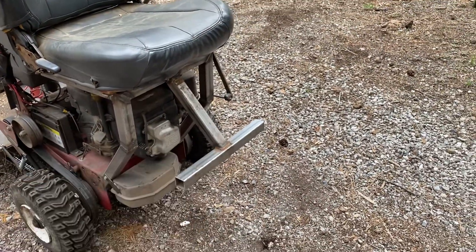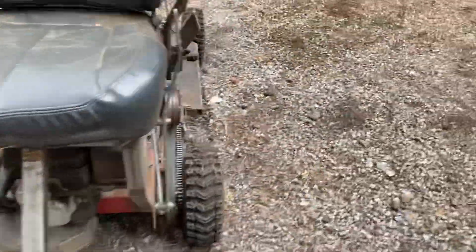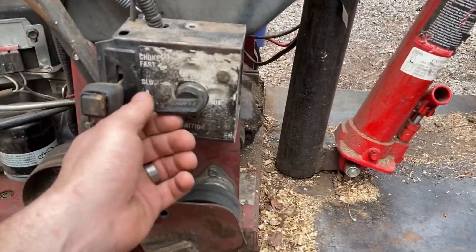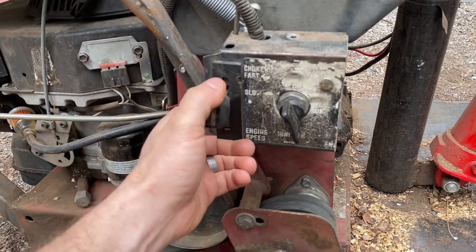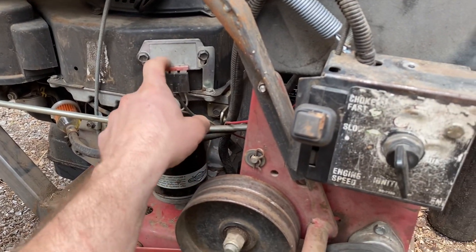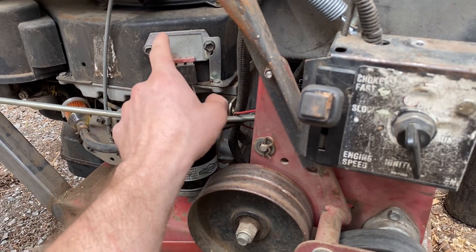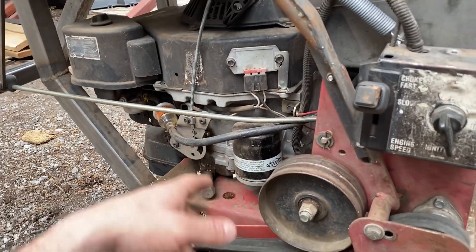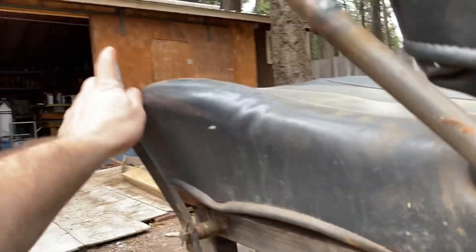The exhaust I had to turn it 180 degrees and then mount it to the side of the seat frame. Over here on this side you can see my little control box for the key, the start and stop, and the choke — a little janky, I definitely need to add sides to it, but it does all right for now. Here you can see the rectifier for the engine that I use to keep the battery charged and run all the electrical stuff. I want to put some lights on this thing eventually so I can plow some snow with it in the winter.